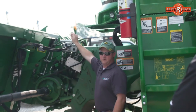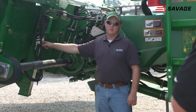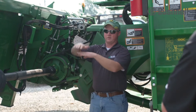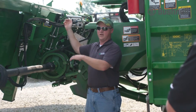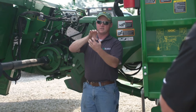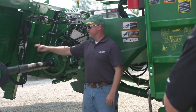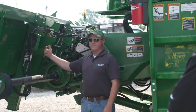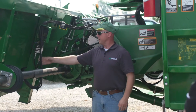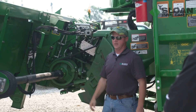Make sure you wipe this off and keep the debris off of it so that they don't leak. That's one reason they went to this little check valve block here. It used to be the check valve was in the combine, so when you disconnected with the reel up in the air, all that pressure was stored right here at these little cartridges. When you reconnected, there was a release of that pressure, which could roll an O-ring or mess up a packing and cause leaks. Now the check valve is here so you have to actually activate something to dislodge it to move oil. If I disconnect with pressure on this side, it doesn't matter because it's stored here — that just makes these less susceptible to leaks.